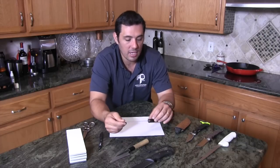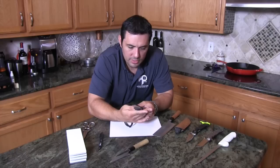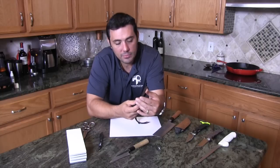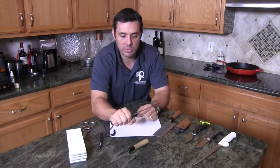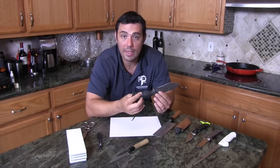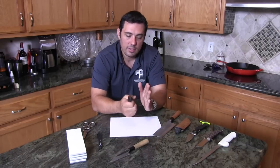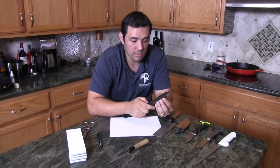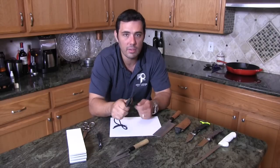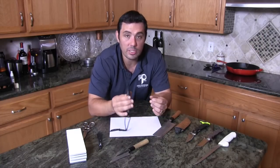Heat treat is very important when we talk about these knives — how they're heat treated definitely matters. This here is a CPM 3V, a very, very good steel but a thicker blank. If I was going to use this as almost like a camp work mini chopper kukri-style recurve, I would want to know how hard they ran the steel. That would affect what angle I'd cut this edge at. I might not want a 17-degree edge on each side, because if it was really hard, I might chip the crap out of it using it as a camping knife. Knowing what you're dealing with will help you deal with it properly.